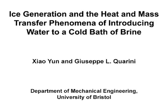The overall goal of this experiment is to investigate the formation of ice and heat and mass transfer when water and high-concentration cold brine are in direct contact. This method can help answer key questions in the heat and mass transfer field, for example, relating to ice production and energy storage. The main advantage of this technique is that it does not require low evaporator temperature and it is efficient.